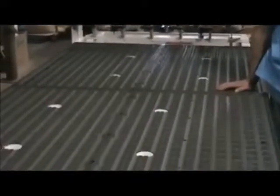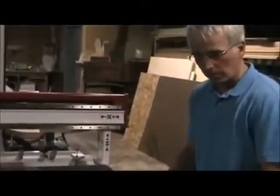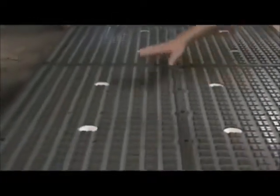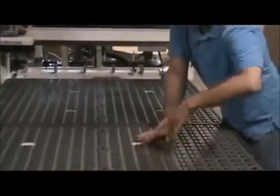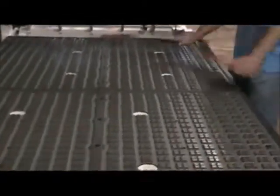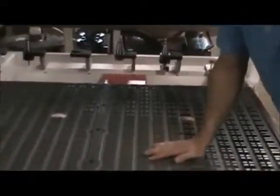Here we've taken off the spoil board, and we see the vacuum table exposed. Bill, tell me a little more about this — I understand it's a four-zone gridded pattern. That's right. We've got a number of different vacuum options, but this is our four-zone option. You can see the different cutouts for each zone — they're four-by-two-foot zones. Each one is gasketed and has the ports going out to the handles in front. A nice phenolic top, very flat, on top of all the steel framework — a really sturdy, stable table configuration.